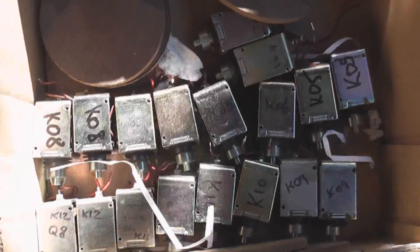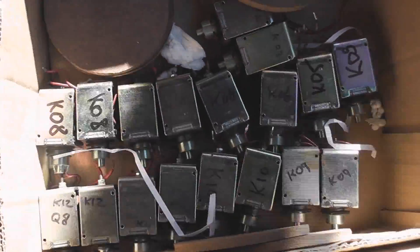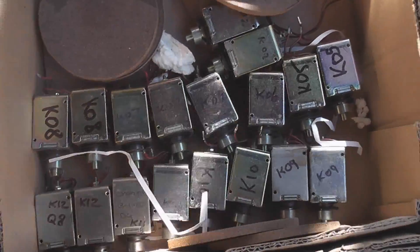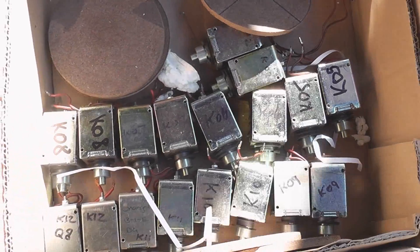The good thing is I've got a box full of these. They're all 100 volt relays and I'm putting them on a 120 volt supply, so they're all overheated and basically throwaways.